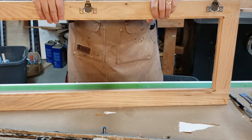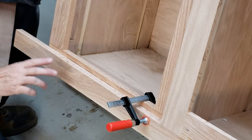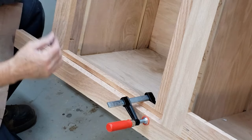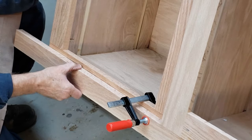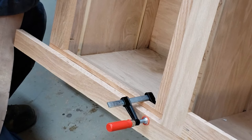So there we have it - our hinges are in the door and they are ready to go. Let's install this. Let's look at something here before I bring the door over. I know I need to have my doors at a half inch overlay. I'm working by myself, which means I only have two hands. So what I've done is I've clamped a board here that is a half inch from here, so now I can set my door in there. Because the door has to be open in order for me to install, that clamp should be fine. So let's put the door on here. I'm going to show you me install one of the hinges up here and then I'll do the other two off camera and then we'll look at the door.